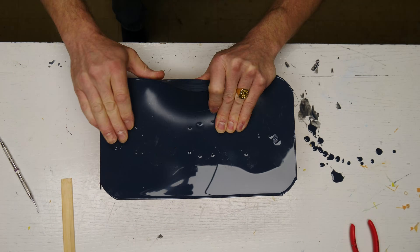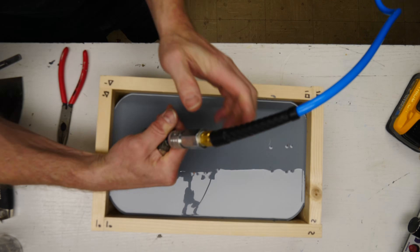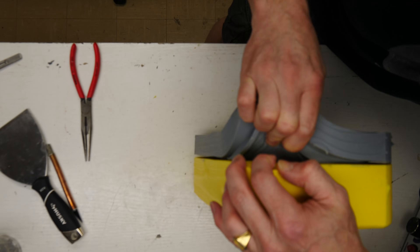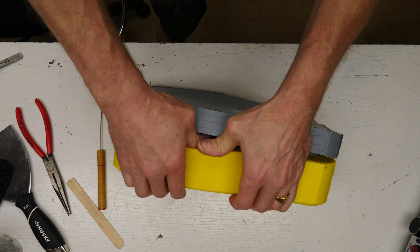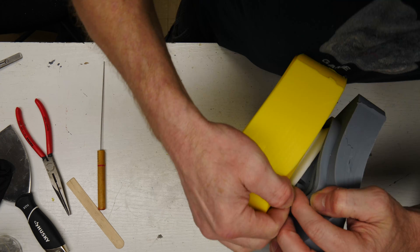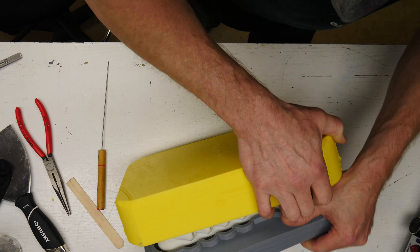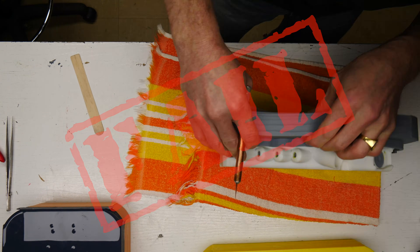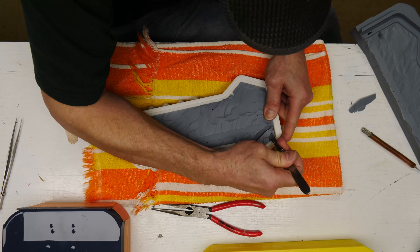Let's remove the copper vent wires and reveal the mold. Taking the second half apart, we're having an issue — the silicone is not releasing from the parts and we don't know why. We are stumped. The yellow one comes off but we're getting some tearing on some pieces, and we never even get the gray one out. We have to cut it out. I'll give my hypothesis later on why I think this is happening.